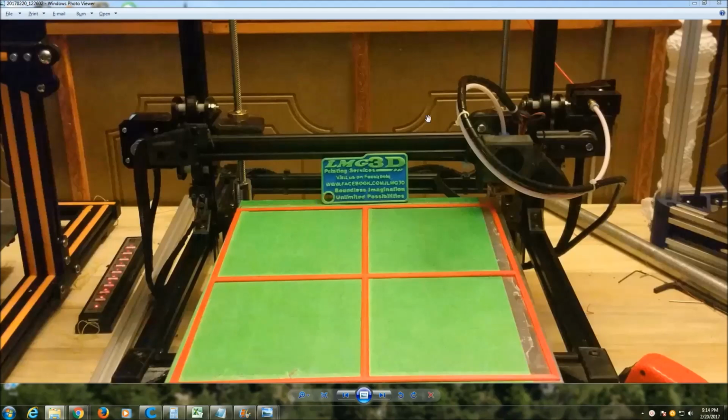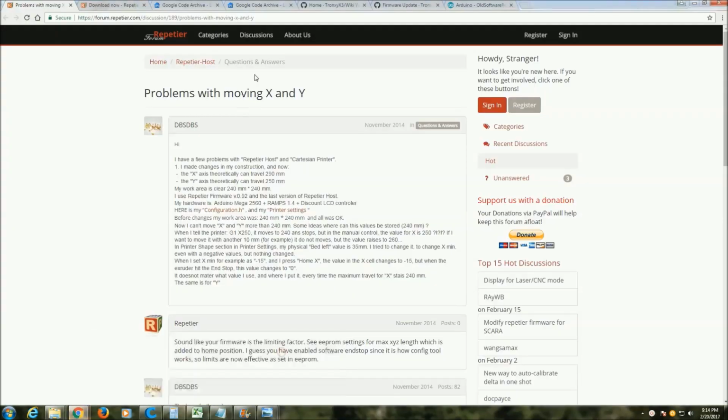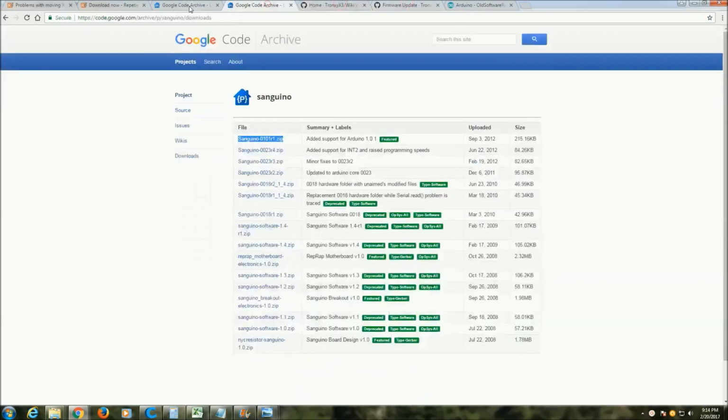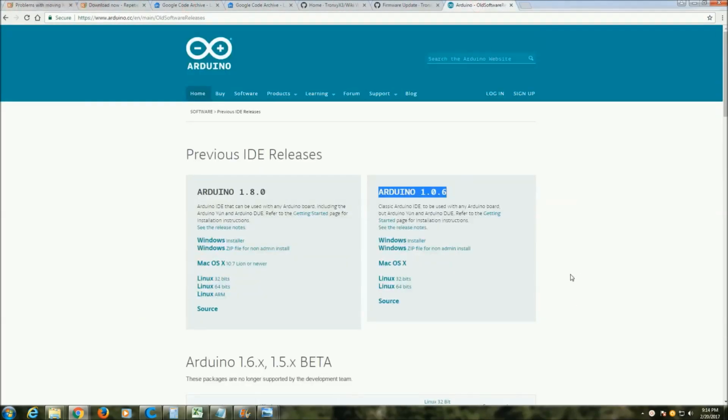The first thing I need to do is install an older version of the Arduino IDE, because I'm running Repetier 0.91 on this printer. When I try to upload that firmware using a current version of the Arduino software, I get compile errors. Now, there are several links here that I will be putting in the description, all of which are relevant to this situation.